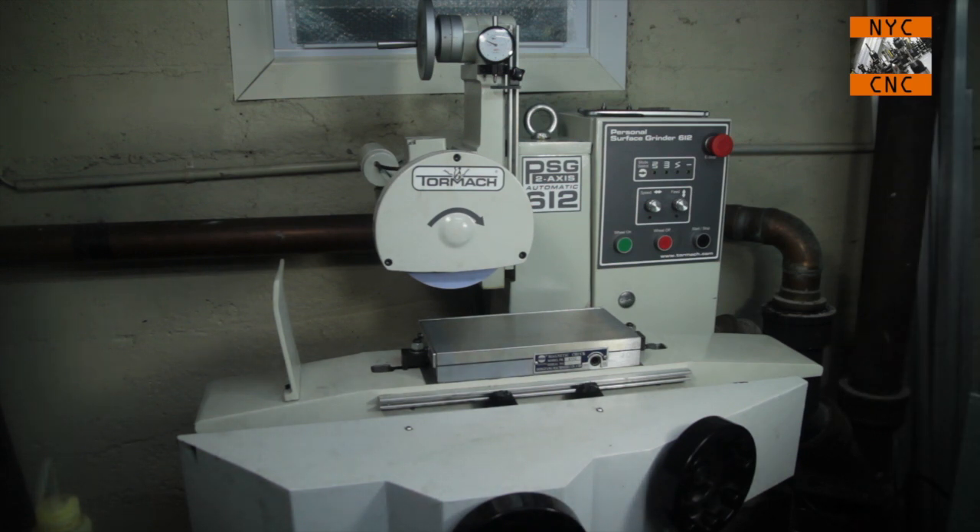For those who may not know what a surface grinder does: surface grinders are great for very precise finish work. Machining can be precise as well, but with machining you're cutting, forming a chip — there's tool pressure and deflection, which can cause problems, not to mention repeatability. A lot of times folks surface grind parts down to final tolerance. You also use these after heat treating, since parts may have moved dimensionally, and you can surface grind any hardness of ferrous steels, whereas machining hardened stuff isn't always practical.